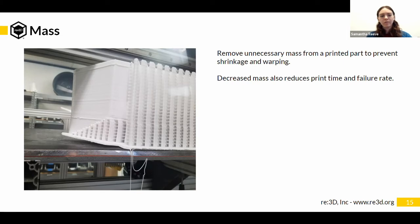There's a balance — look at the geometry of your part and consider how likely it is to warp based on the material. If you don't know if a material is likely to warp, generally the higher the print temperature, the more likely it is to warp. Usually go by nozzle temperature, then bed temperature as secondary. For example, PETG and PC print within 10–15 degrees of each other, but PC's bed temperature is 45 degrees hotter because PC is a lot more likely to warp.